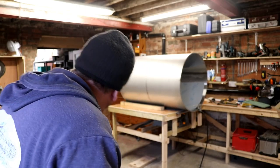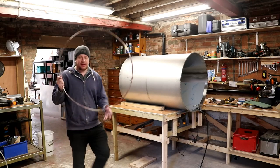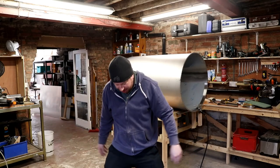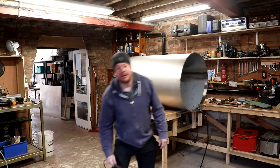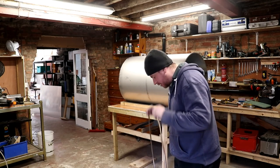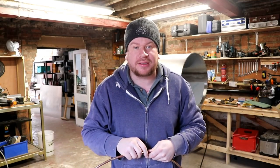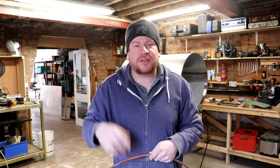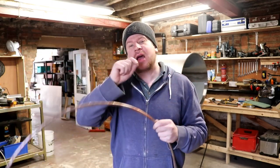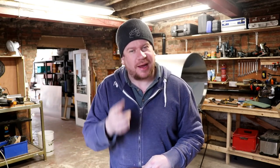Yeah, I am. So I'm gonna put in this copper hoop. Yeah, anyway. So this is gonna go on the inside to back off the weld. Oh, I've lost a bit out of it now. I'm gonna have to do the outsides first. Scratch that then, this will go in to back off the inside and I'll be welding on the outside, and then I'll weld on the inside another day. Yeah, that's what we're gonna do.